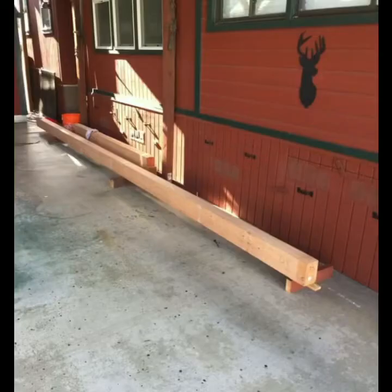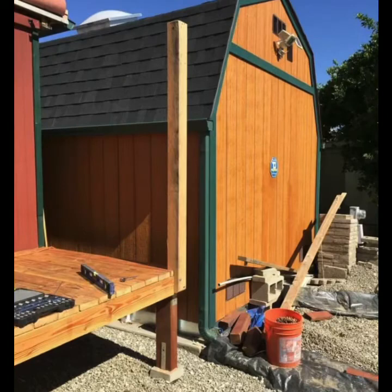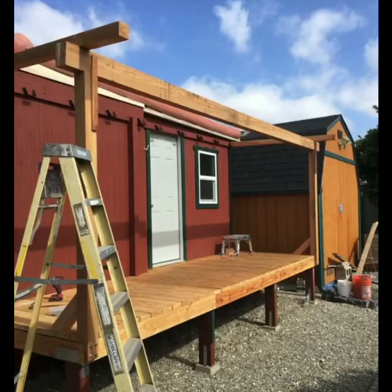The 22-foot 4x6 rough cut beam has arrived. I will need help to get it placed. One of the 4x4 rough cut posts are installed for the beam. A close-up shot of the posts being installed with lag screws. A quick mock-up to check for proper drainage. It is correct. The 4x6 rough cut beam is installed.